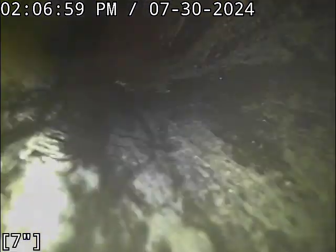So we just went backwards there, back inside the house, zero standing water going back into the shop. And right here, you're working with about 1/4 inch of standing water, and then a little bit of backflow water. I've got a bathtub running full bore, so some of this water would dissipate if I shut that off. So 1/16, 1/4 inch of standing water, that's not the kind of stuff I'm concerned about causing flow problems, not unless the line is being abused very heavily. So that section of pipe has adequate flow through it, and the pipe is intact and in good shape.